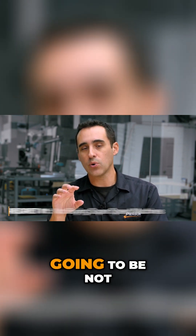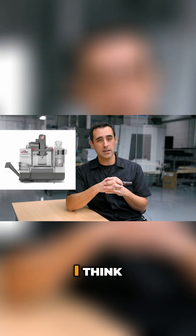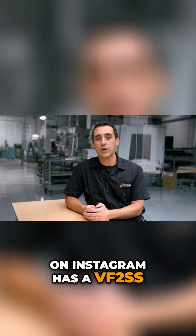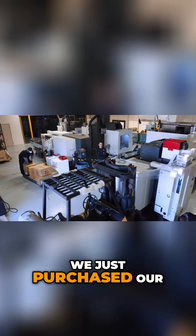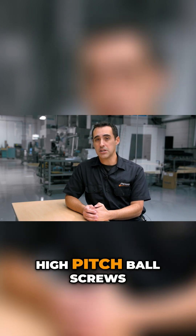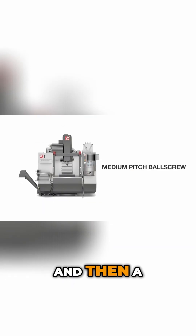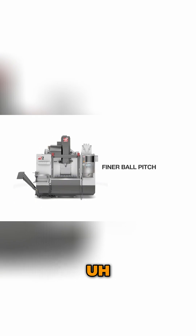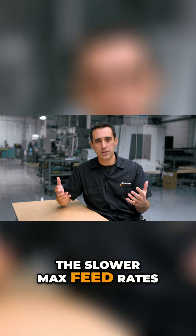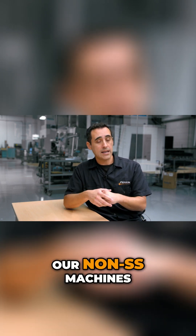The first thing is not buying super speed machines. The VF2 SS is by far Haas's most popular machine — it seems like every other guy I follow on Instagram has a VF2 SS. It's a great machine; we just purchased our first one. But my decision not to go with super speed was that I was gun shy about the high-pitched ball screws because of the super mini mill 2. You have a medium ball pitch with the VF series, and a finer ball pitch with the Haas VM mold-making series. I was okay with the slower rapids and slower max feed rates — it's like 650 or 600 inches a minute cutting on our non-SS machines.